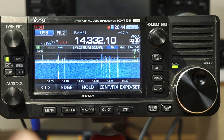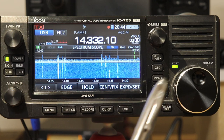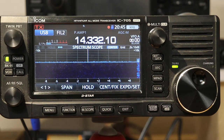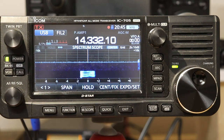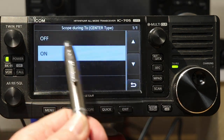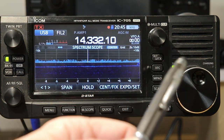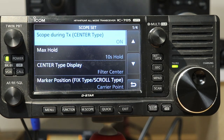You'll notice that as I press the microphone button to transmit, it just freezes in Fixed Mode — that's the only option there. If I go to Center Mode, where the center of the scope is whatever frequency I'm on, you can see it actually shows my voice and the scope keeps running. If we turn this setting to off, then when we're in Center Mode the scope just freezes like it does in Fixed Mode. I like it on — I think it's a useful thing to have.